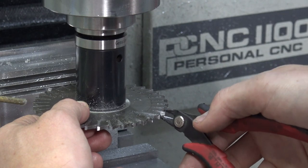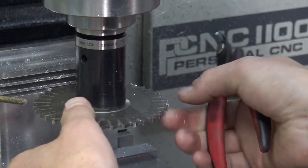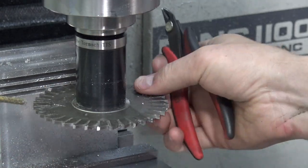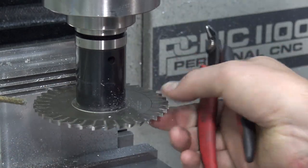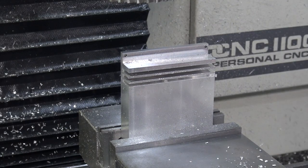None of these were really on there. I mean, you can get them really welded in there. Didn't take but a second to stall the spindle out because it obviously wasn't cutting at all. So let me go repost this and let's move that coolant line back to where it's really flushing out that chip. I gotta say, this is an example where I really like PathPilot.